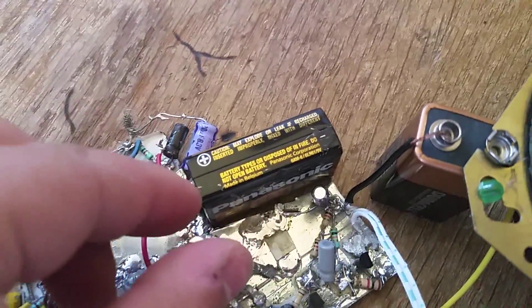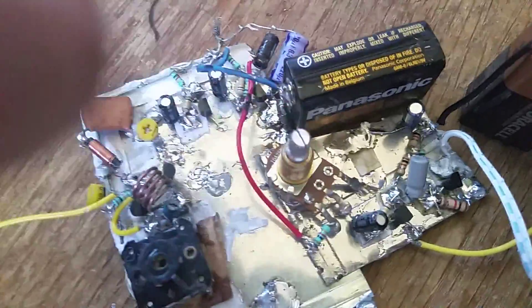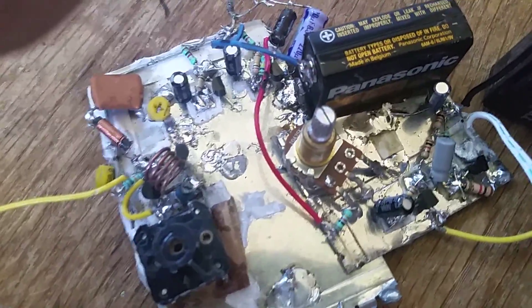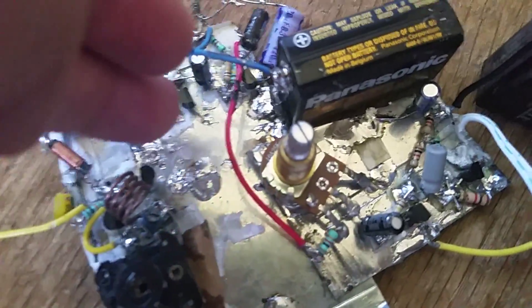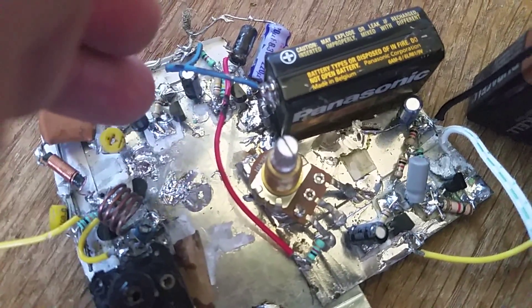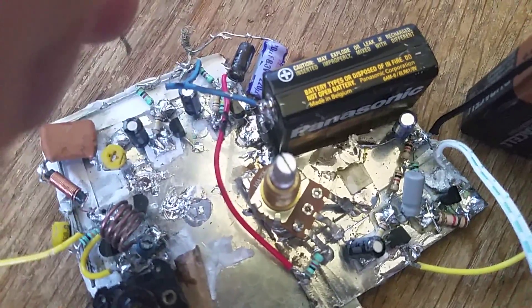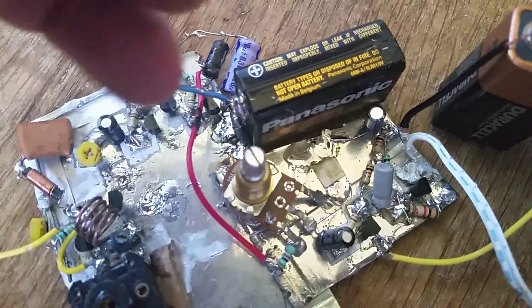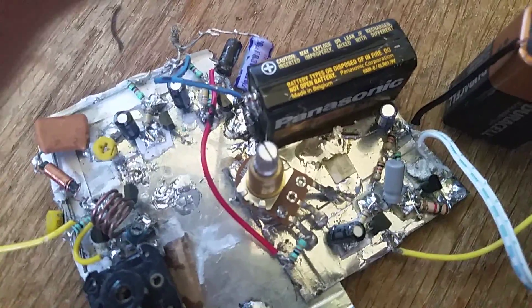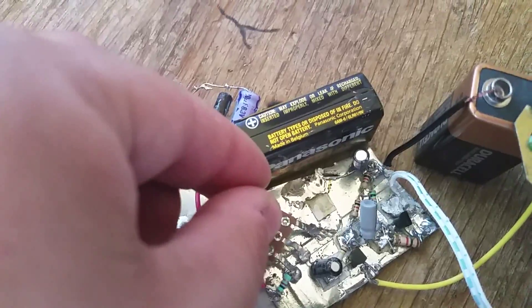This is the construction method. You can see how it was built — basically I had a piece of sheet metal, then I glued a tiny piece of paper on top, then put a piece of metal on top of that and glued it down. That gives you little pads you can solder components to. It's kind of ugly, but it sort of works.